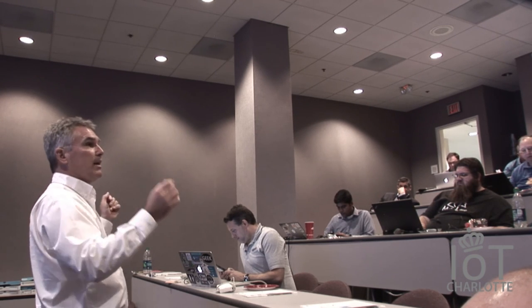So it hands down the characteristics that the central says, these are the characteristics of the connection link. So now we set up a connection, and now you as the peripheral tell me what you're going to send me. And this is part of the negotiation in the stack. The stack comes back and says, here's the characteristics. If it's an existing profile, it's easy to send. If it's a custom, it has to know all these other pieces. And those pieces get sent, you put it in the right place, and it gets sent back over. And now we start communicating.